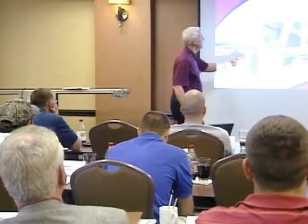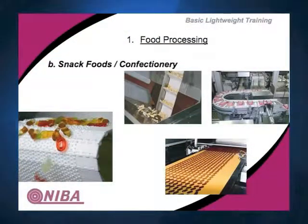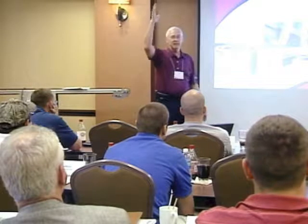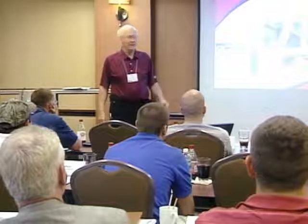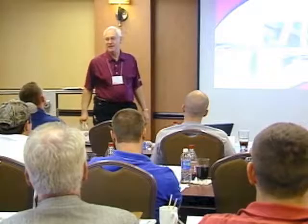Here we've got a boatload of those snack treats going through a system — it could be chocolate for that matter. And here we're moving material with an angle cleat on a flat belt in a trough, just to elevate product from one elevation to another. It's going in from a hopper and being conveyed up like an elevator — that's the most efficient way.